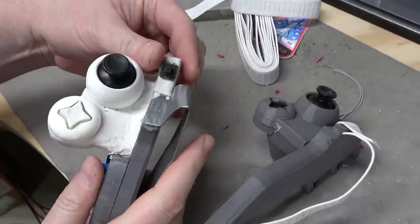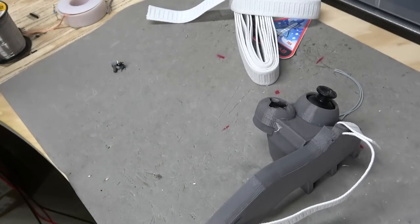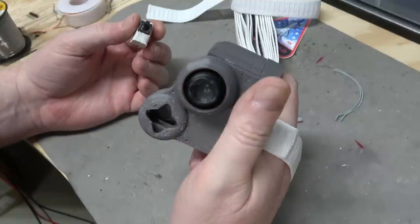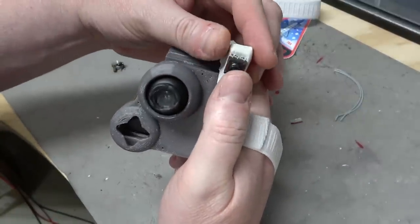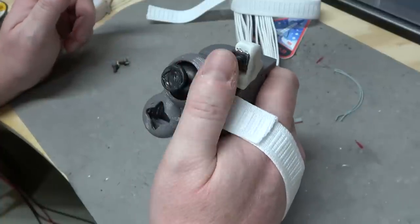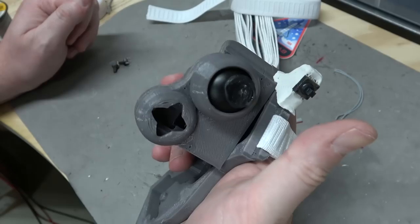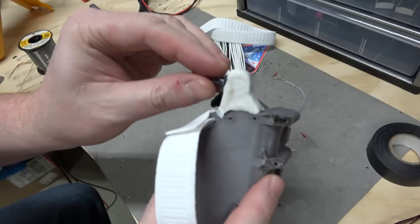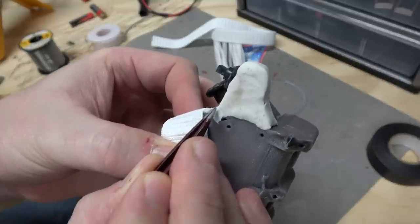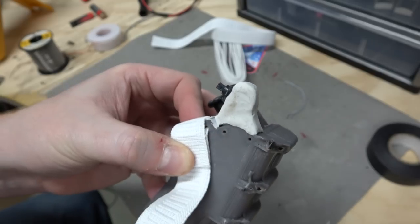What we can do is we can rip off the hat D-pad from the clay model and then just stick it right on here. So here's my thumb. So I'm going to put my thumb over there, bring that to my thumb. So I'm going to position this as best I can in the clay, and then I will build up the 3D model to match this. And then with the hat button, I'm basically going to take this point here in the 3D design, get the angle, go up and come back down, and then position the switch.